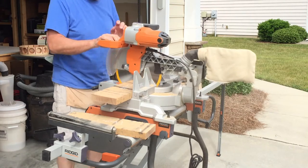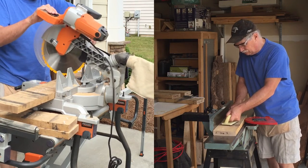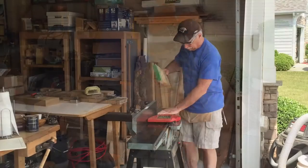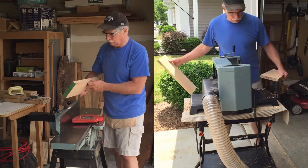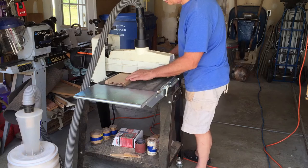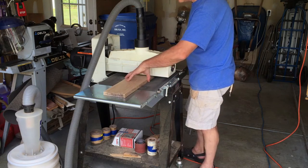Quarter-sawn white oak is the traditional wood for mission-style furniture and furnishings, so that's what I'm using for this project. I had a one-by-five-quarter by six by ten foot board that needed to be cut into lengths and then face-jointed. Once completed, I went to the jointer to straighten an edge, then to the planer to make the two sides parallel. I did that with every piece in this project. After the planer, I run them through the drum sander — my older planer gives a lot of snipe, so I use the drum sander to clean that up and bring parts to finished thickness.